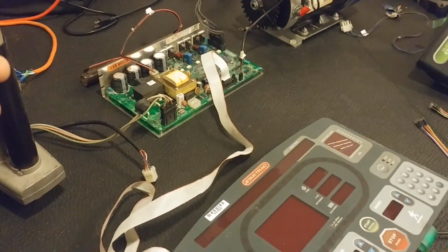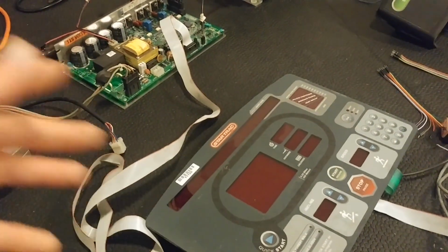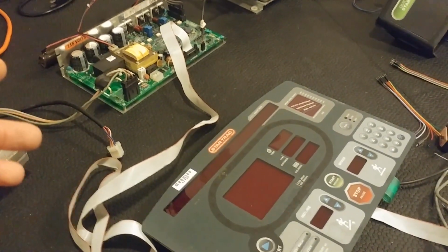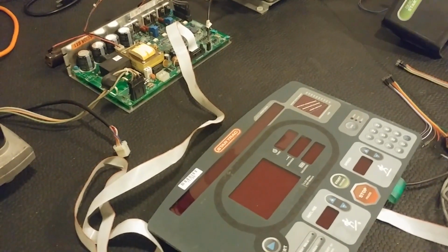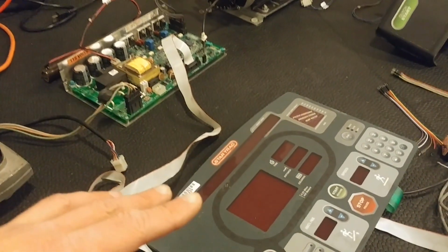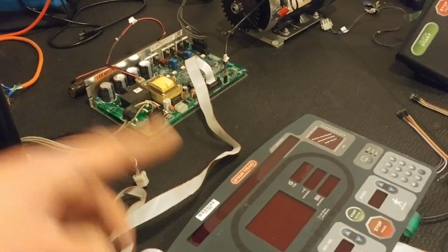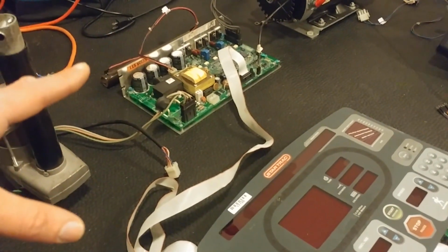I guess technically you could also just use the control panel, right? Put this up by the lathe, put some aluminum in there, then turn it up to 8 miles an hour. If you're putting steel in there, turn it down to 4 miles an hour, a brisk walk. And if you're putting plastic, crank it up to a 12-mile-per-hour sprint. But I don't want to do that. I'm ridiculous, I'm not that ridiculous. And just by the principle of the thing, I want to use the VFD as a VFD without the panel. And as you know, I've already figured it out, but it's the process that's important.